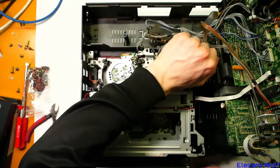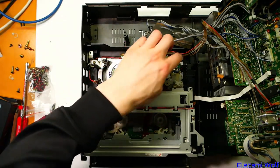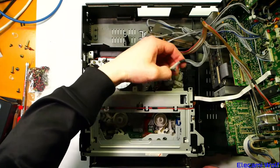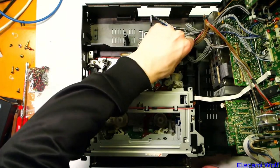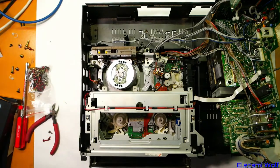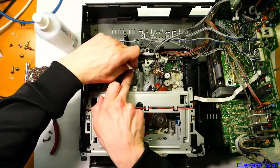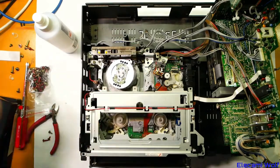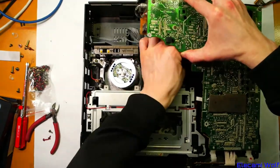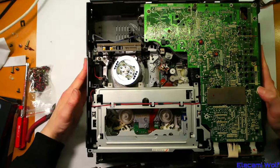I've got quite a lot of wires that go down there — it must go to these sensors: the solenoid and the mode switch. There's a flex board there that comes off that piece. Just wondering why it's got a shielded core in it. Oh, is this a dew sensor? Okay. Head amp. We'll clean the head better properly, and there's a strip of paper there. So it should be alright — we'll lay this down, make sure we've got all the wires in. Join up the video cable and we'll power it up.